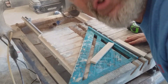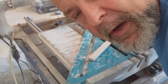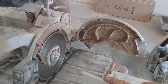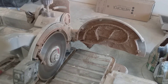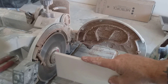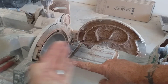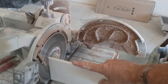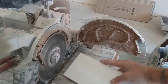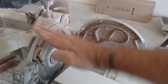Success! That's how you do it. Another thing you can check — I'll show you something else. This is another way to make sure your saw cuts nice and straight. Put a piece of tile — as long as it has a 90-degree edge — flat on the table. If the blade is touching all the sides evenly, that means the blade is cutting true to your table, perpendicular. And on this one, it is.